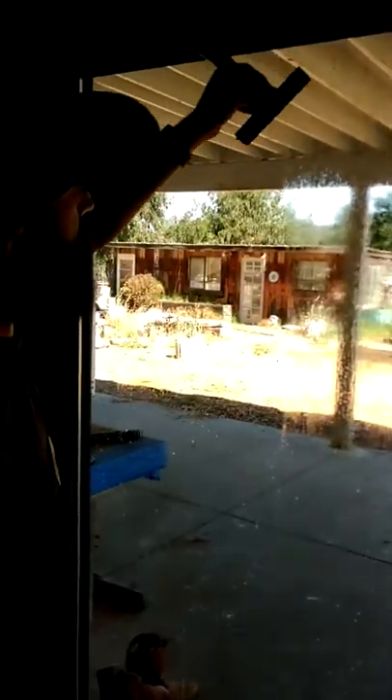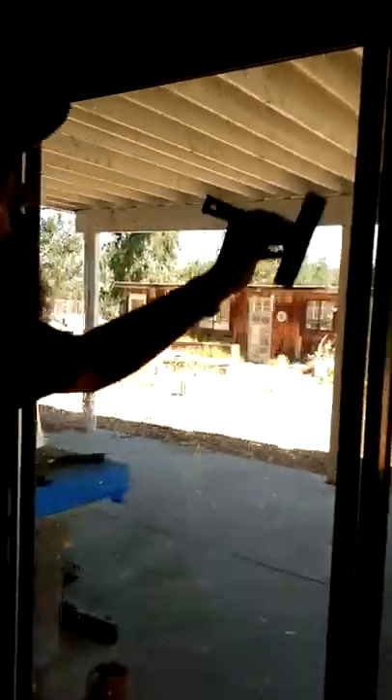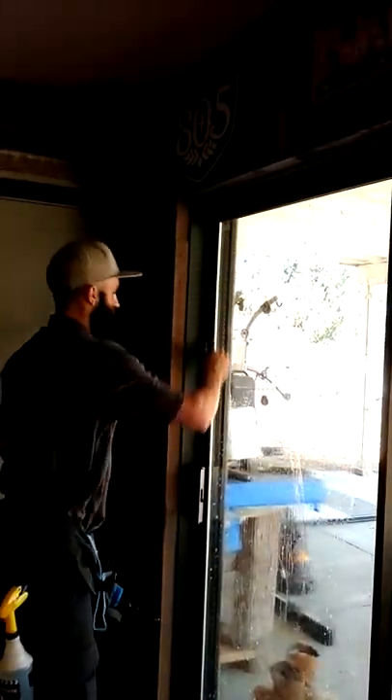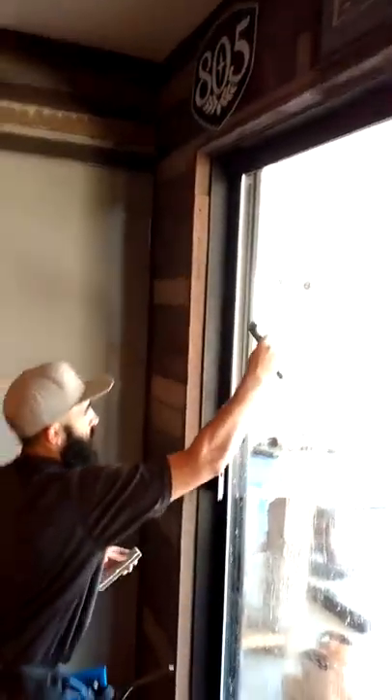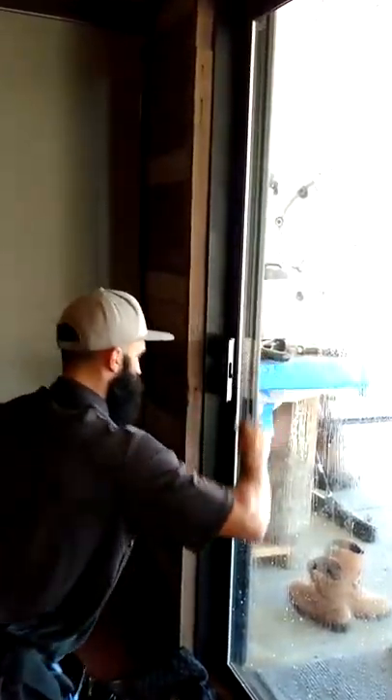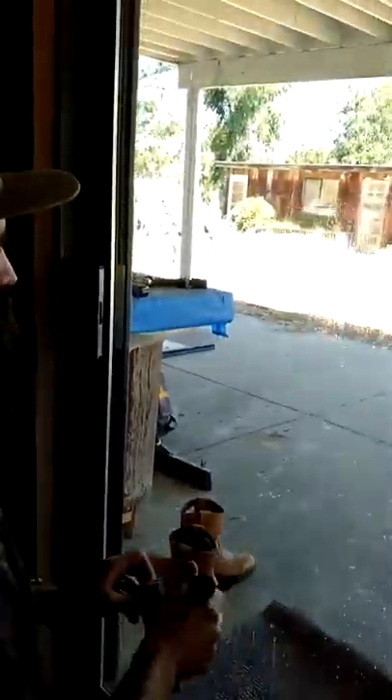This feels 100% smooth, so I'm going to just razor blade it as you normally would. The main focus is on the edges. The center is important, but the edges is where all your containment comes from. I'm getting the tip of that Triumph blade underneath the rubber and just being nice and thorough.